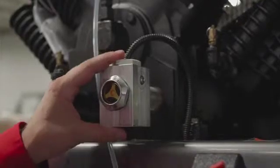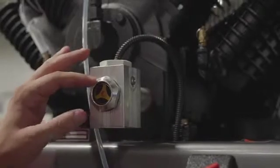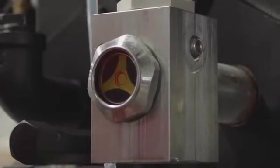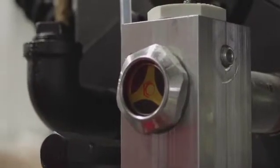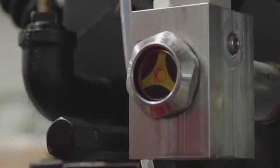Another great feature that we have on a lot of our piston units is a low oil level switch. This will actually stop the electric motor if the oil level falls below a certain level, which prevents any kind of damage to your compressor because of low oil situations.